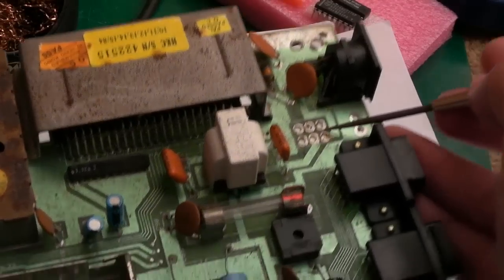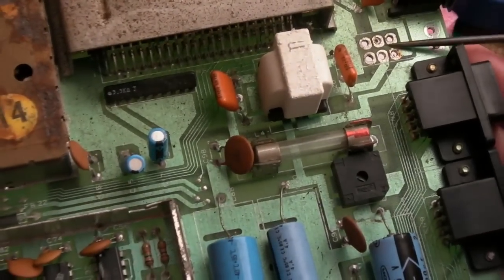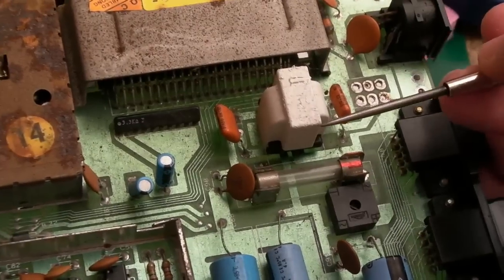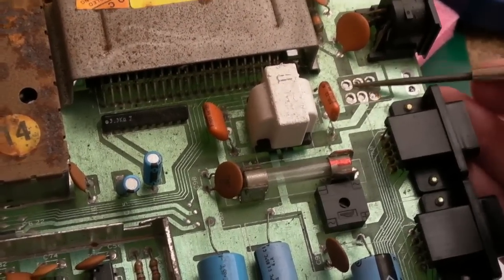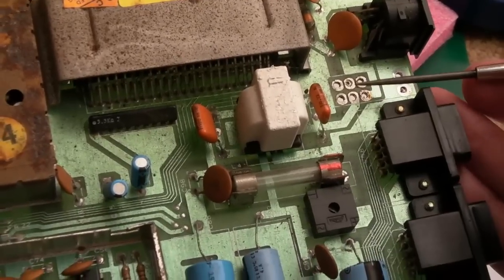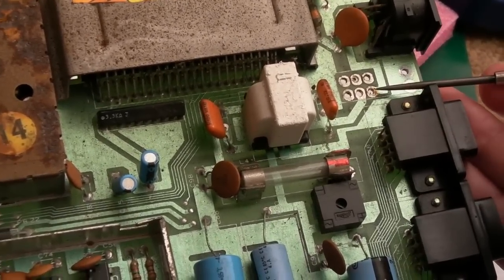So the final thing we're missing here now is, I think, the power switch. We should then be able to get the chips in and test it. Now, before I get the chips in, I'll be measuring voltages, but let's get a power switch on there, and then we can whiz over to the box and do some checks and start to introduce the chips.